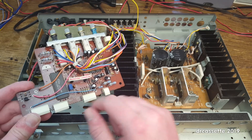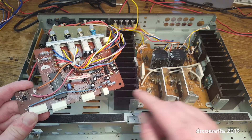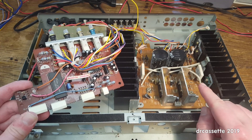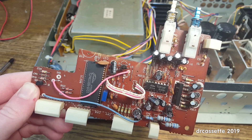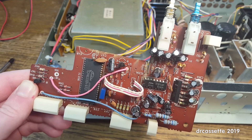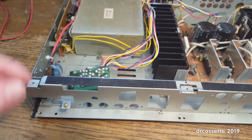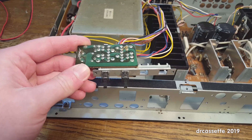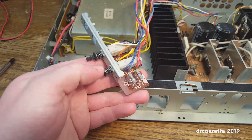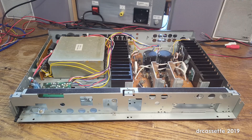That is very good news, because it means I can just simply cut the orange wire and it's not going to keep the main amplifier from working properly. The microprocessor board has finally been taken out, but there is a chunk of it missing — that's because I used the Dremel tool to cut it out. This is the part of the board that contains the speaker selector switches, and I still need those. Disassembly of the amplifier is now complete, so I can start reassembling.